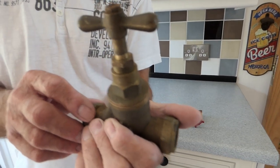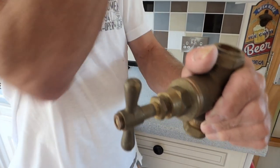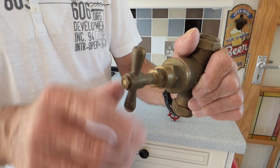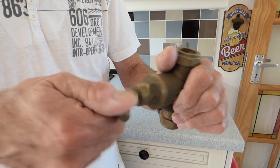Now here is a humble stopcock. It will usually be pointing upwards like that pipe coming up through the bottom of the cupboard — normally it's in the cupboard, that's why I say do locate it. Now what you've got to do is just turn it off, make sure it's free and easy.